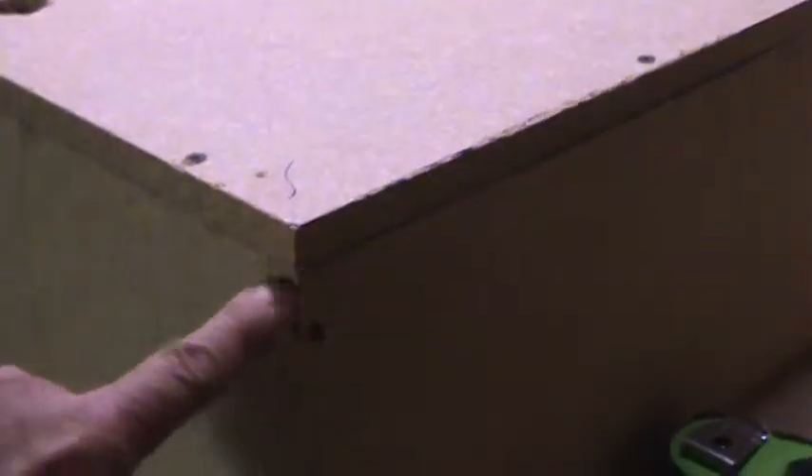I'll take the sheet of glass out — sorry about all the jostling when there's only one of you. I'm going to turn this crate over. Here's how I did the bottom: I screwed it in from the sides — it has more strength that way. The bottom piece measures 30 inches long by 8 inches, the same as the sides. From here to here it's 8 inches, and the bottom is 8 inches — they both fit underneath the side and lock together, creating a strong structure.